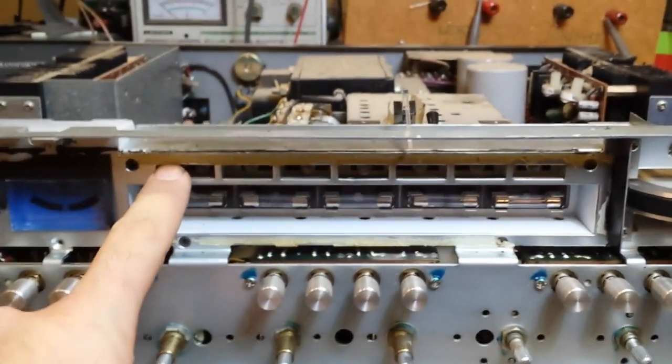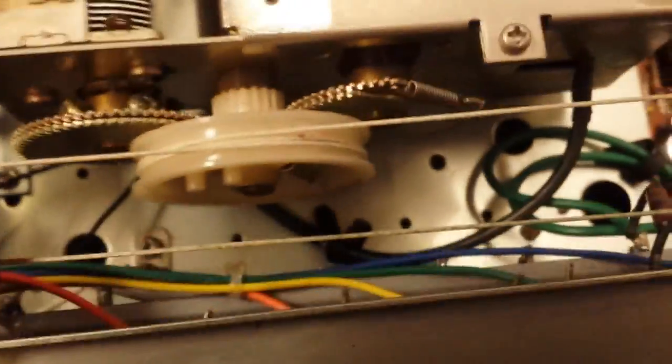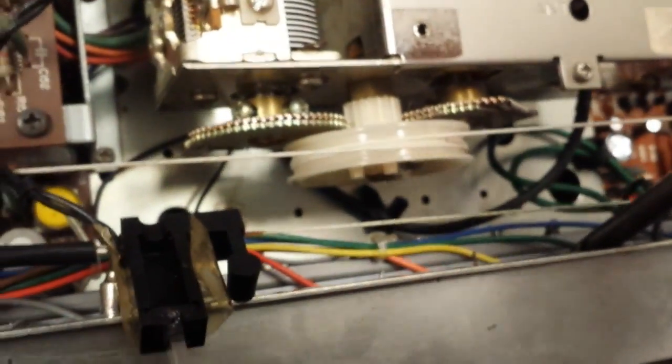In order to replace these, you better be a good solderer, because you're going to need a 50 watt iron, some really good wick, and a lot of patience. The best way to pursue this is by desoldering the little jumper resistor there — you want to take that out. And then there are screws that hold the upper portions to the lamp housing which you want to remove. This part of it totally sucks because you're going to have to finagle this thing out of here. The reason why you don't want to leave it in here is because if you nick the dial cord, you're going to have to restring the tuner, and that's not very fun on these machines, so avoid that at all costs.